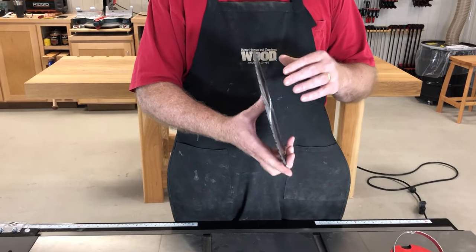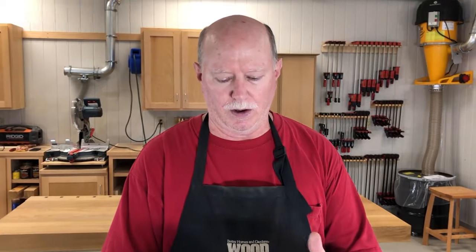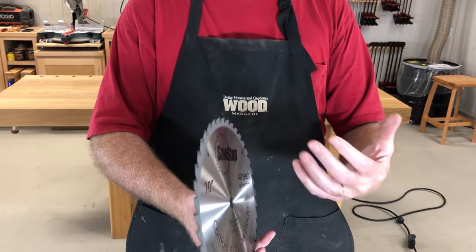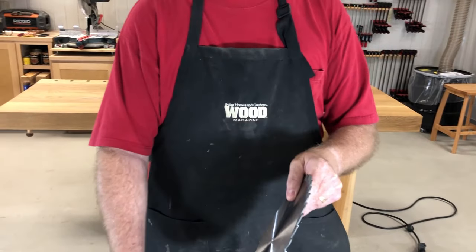It's not enough to shock you, but it's enough to create this fuse. So if you touch the blade with your finger, with metal, or anything conductive like wet lumber, right away that current leaves the blade and goes into you or the metal or the wet wood. And as soon as that happens, that triggers the safety device.